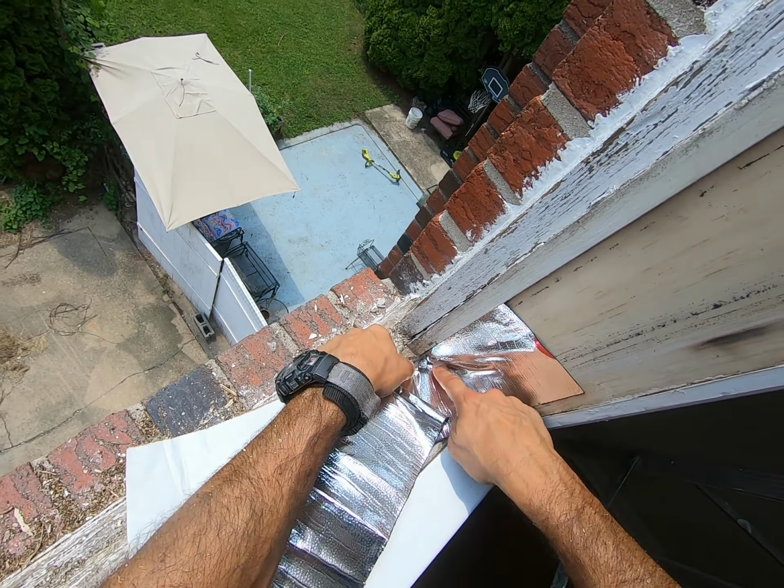So set those aside. The first thing I wanna do is take the screen off because screens are annoying to work with. And if you put a hole in them, it's annoying to redo. Unlock the bottom sash first, slide it up, use these levers to push in and tilt the sash. Now, this is important. You're gonna use one end. I'm a righty, so I use my right. Hold on to something here. You're gonna push up until this gets loose, and I'll show you how that works. On this end, very easy, push up and out.